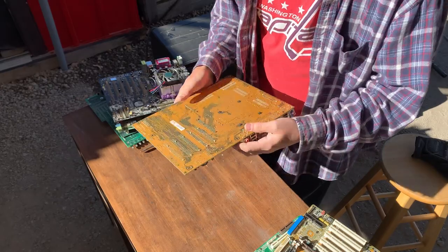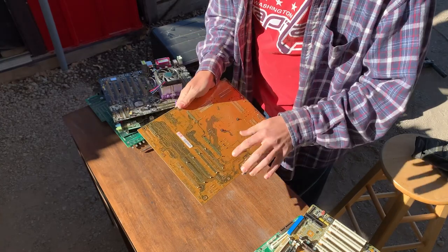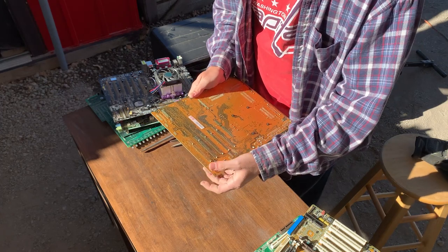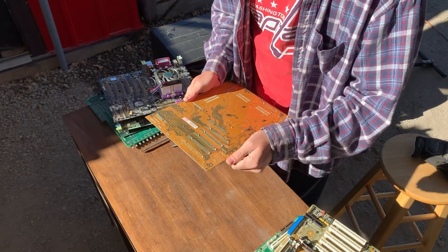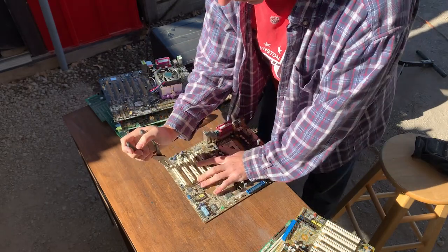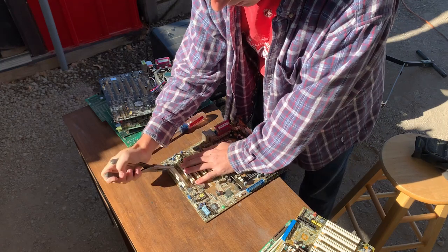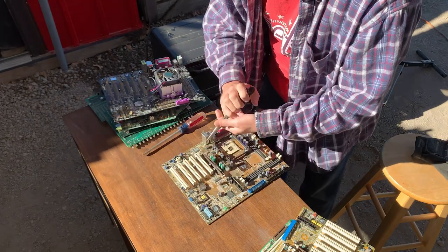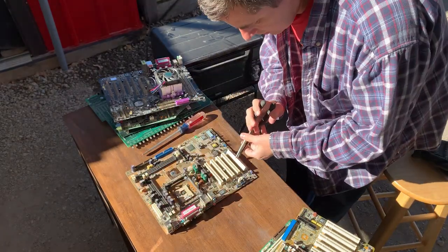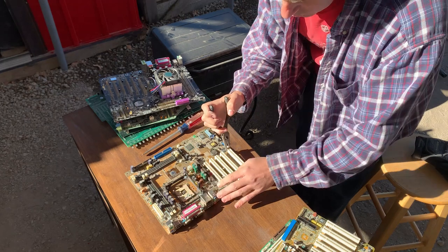These PCI slots have white — well, whatever color the plastic is, because here are brown ones. These pins are just toggle pins that help lock the plastic in place, so as you're inserting and removing cards from the slots you don't move the plastic around a whole lot. I like to push it forward until I hear it pop. Sometimes it'll just let go at that point — this one did not — so then I have to pull it back. It might be easier if you turn the board and just push it again until you hear it pop, and then it just wiggles free.